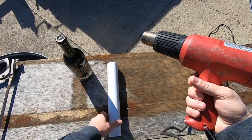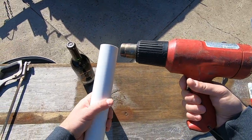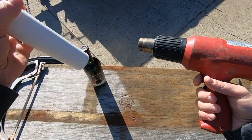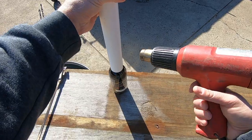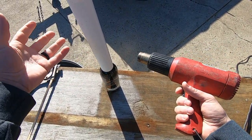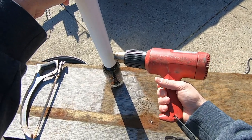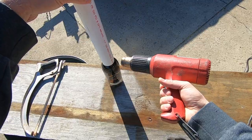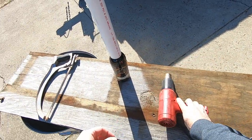This part is fairly easy. Grab your heat gun and start applying heat to the outside and inside of your pipe. Whenever it gets warm enough, flip it over and plop it down on your bottle — this will create the flare. If it's not flared enough, heat it up as much as you need and continue to apply heat as you spin it around the bottle. I'm going to speed this process up so you don't have to wait around.